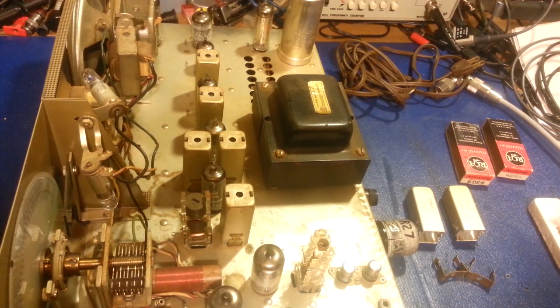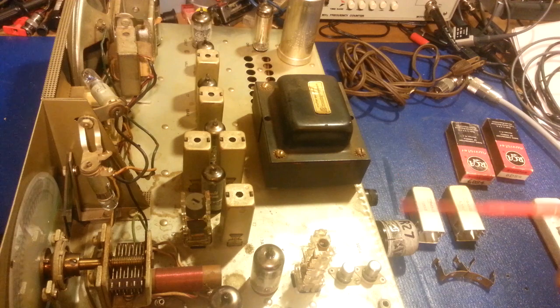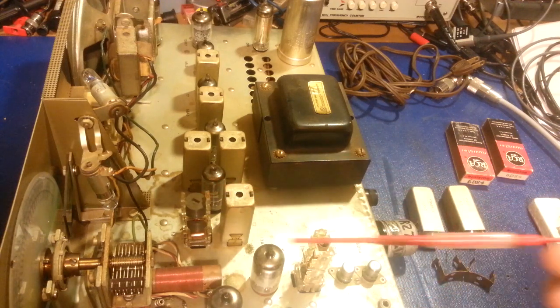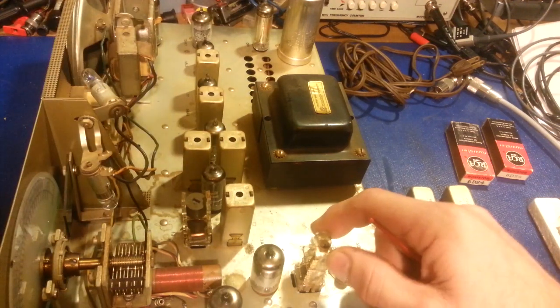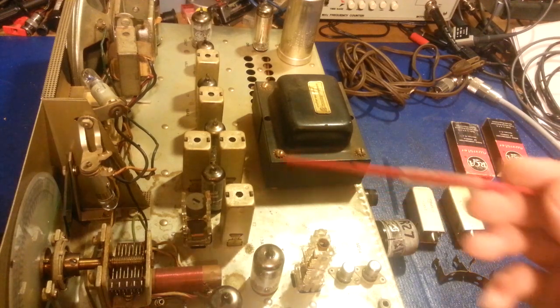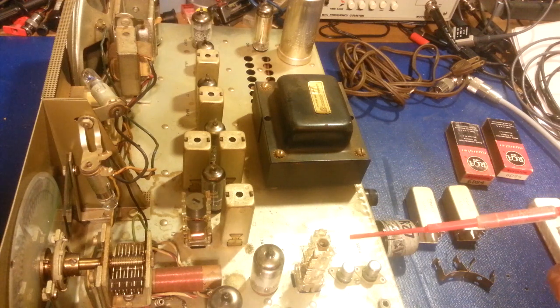These radios were actually known for having extremely good receive back in the day. They had a lot of IF transformer stages, and one thing that made them very good receivers was the IF cans they used - all these little guys right here. There are two can housings sitting on the bench. I have the metal cans off of them because I want to show them. This has SMD - and we're not talking about surface mount components. SMD stands for Silver Mica Disease, basically the cancer of the electronics world - slow and deadly to a radio.